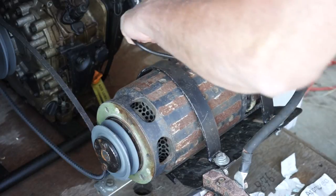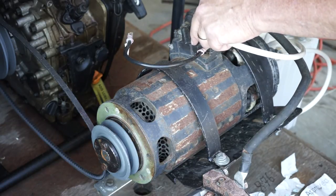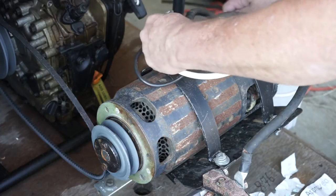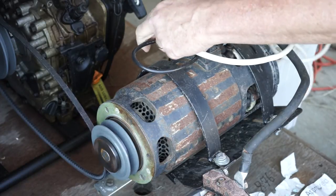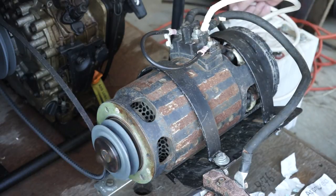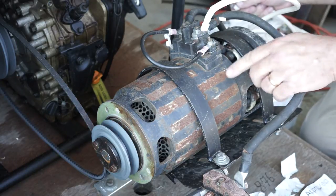I'm going to unhook my field wire. It has some magnetized stuff in it right now. If I touch the negative here — nothing, not a thing. And if I put it here and touch it — not a thing. But when I put my field over here, it runs. What I did is called field weakening — I took the field off, so there's almost no power. It's just a slight residual magnetization, and it takes advantage of that to start up.